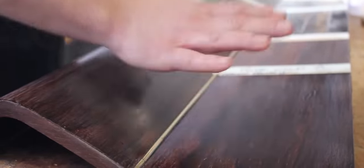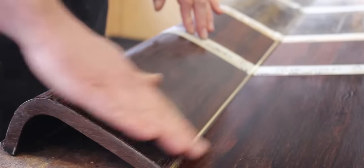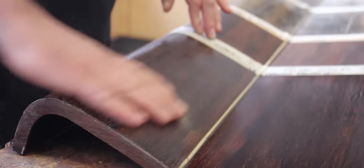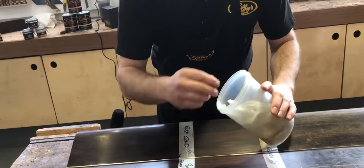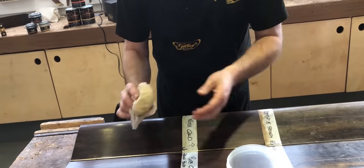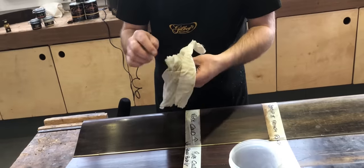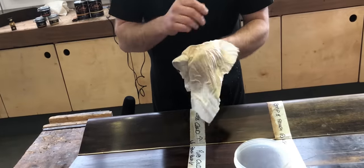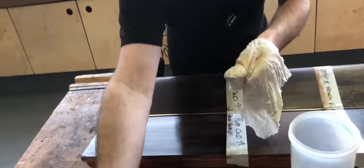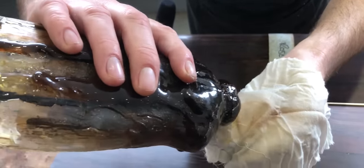So that's fadded. I'm now going to start rubbering the surface, using a rubber to body the surface of this finish that we have here. And here is a rubber that we use in the workshop. Here's a small one, sorry, a small area. Inside here is a bit of cotton wadding. I'm going to charge that cotton wadding with some special pale polish.